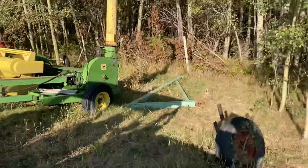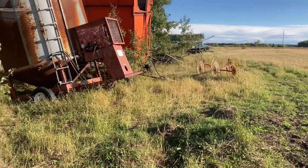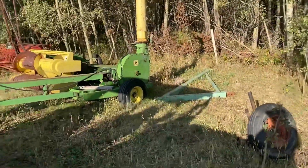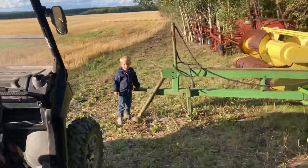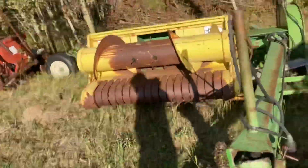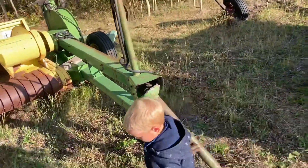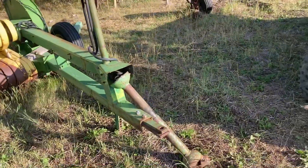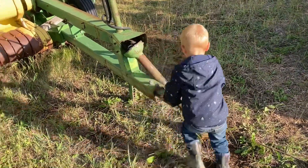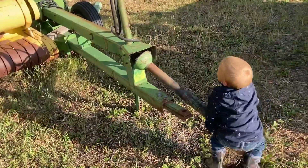We don't try to accumulate too much old stuff — in fact the salvage guy was here quite a few trips this summer taking lots of it away. But some of it stayed, and maybe that's a good idea. This forage harvester has a PTO shaft and I think it will fit in place of the wrecked one. Of course it's five o'clock, so the local parts store would probably have that yoke, but everything breaks down at 4:59 and screws you for the evening. If we have this and can get it going, we won't have to wait.